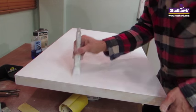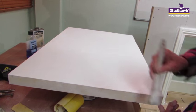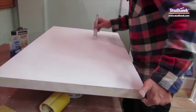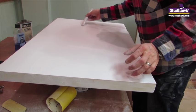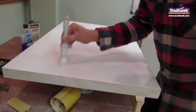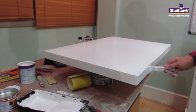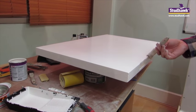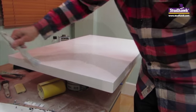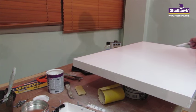So it's one stroke all the way. We've got a beautiful flat finish all over our door. Going at this speed will help you because on a larger door, the coat at the top will already be starting to dry or skin, and you want to hit it all with the same finish. Make sure we've covered all areas. Just so that we don't get a bleed edge — those lips are important, otherwise you can build a ridge of paint at the edges of your door. So I always like to give them a touch.